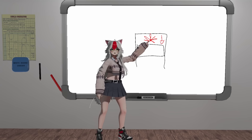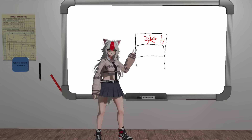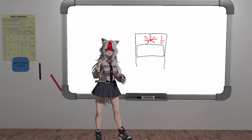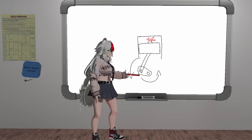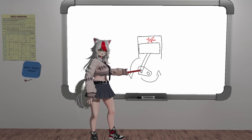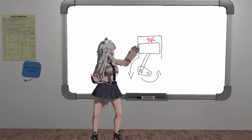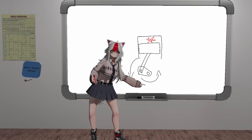Now this is what we can call a combustion chamber, because it's a chamber where combustion happens. So you have your cylinder, and inside the cylinder you have your piston. Now as that piston goes down, how can we convert that downward motion into rotating motion — into something we can use to rotate the tires with? That's where your connecting rod and crankshaft come into play. So as the piston goes down, it pushes the connecting rod, which converts our linear motion into rotating motion. We have our fuel, it ignites, pushes the piston down, which in turn pushes the connecting rod down and rotates our crankshaft.